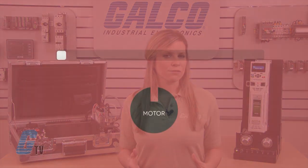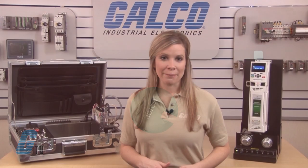There are two methods of controlling the position of an application through a servo amplifier. The first is speed. An analog voltage input is given to adjust the speed reference and will use full torque to get to the position set in the index. The speed can be adjusted by an external controller.